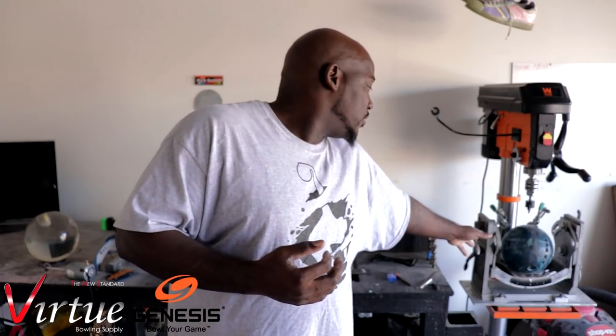Drill press, any drill press you want, find it, doesn't matter. Price is up to you. Plug cutter, I got mine for free. It came with the jig. Ask a pro shop, try to buy one. It's like, hey, you have an old plug cutter I can use? A lot of shops renew them, so you don't want it to be sharp. You don't need it to be sharp. You just want the contour of the plug cutter to calibrate your machine.